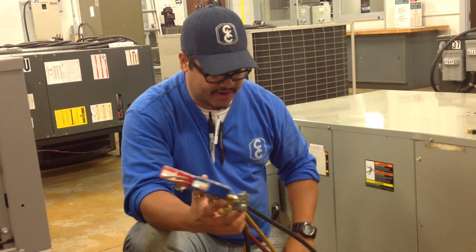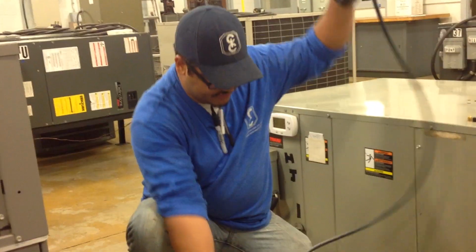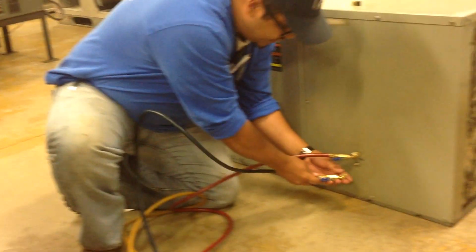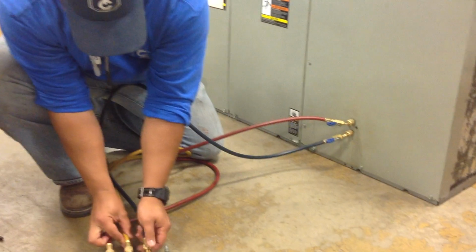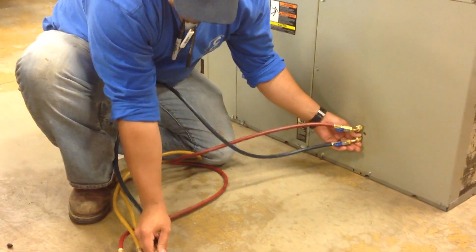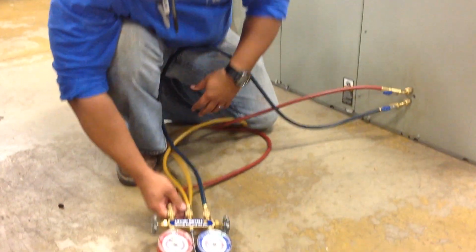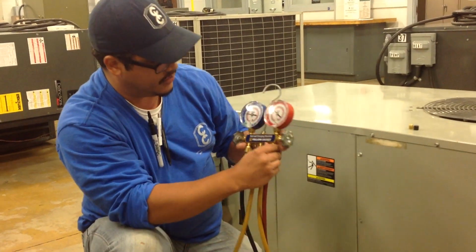Anyways, the system has run for a little bit, so I'm going to go ahead and hook up the low side. Same procedure. You can start it here, just a little bit, and loosen up this two and a half. Then you come here, and close it, both at the same time. Now both of your lines are purged, and they're reading.